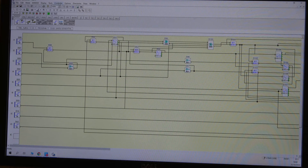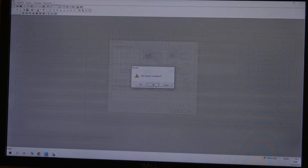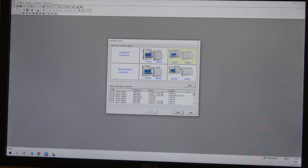Now let's wipe everything and create a new program. I'll clear the content of the controller — yes, get rid of the whole thing. Content cleared. Before starting a new project, I need to select the correct controller model by matching the serial number on the side of the unit. This particular one has analog inputs along with the standard digital I/O — eight relay outputs — and I can confirm the part number from the label.